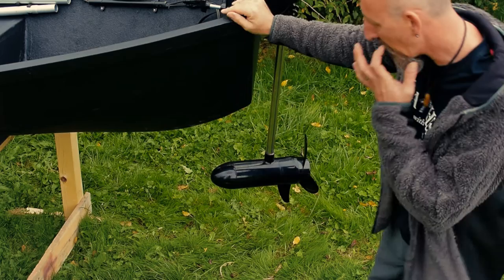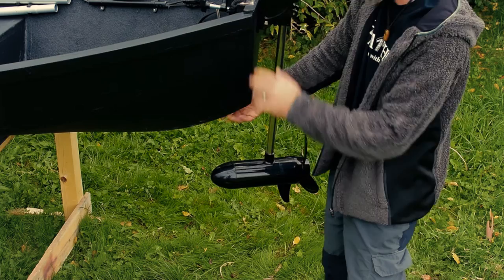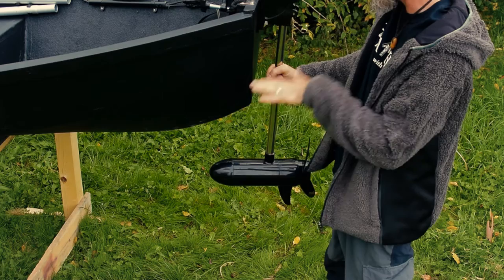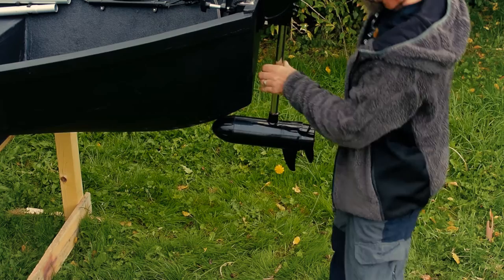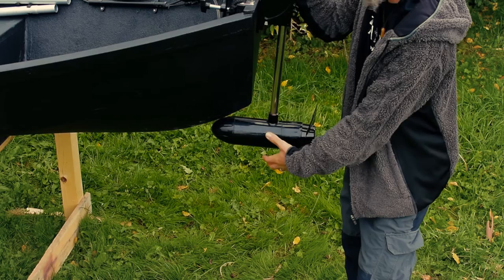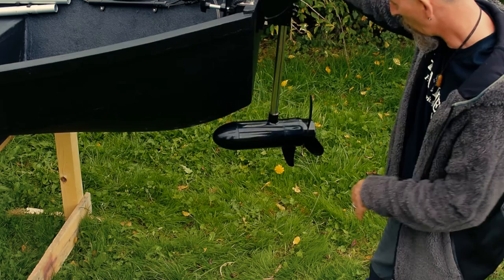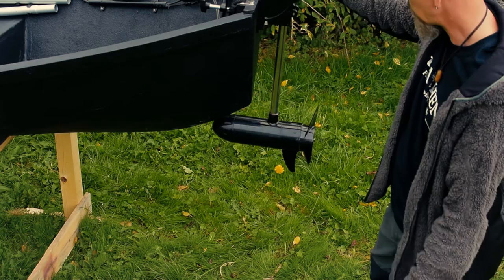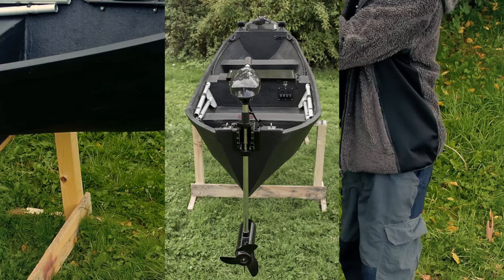The nice thing about how this is set up — it's a flat bottom boat that goes up towards the bow and stern like a traditional open canoe or skiff. In really shallow water, I can just adjust the engine up. I've got clearance for steering, and this sits well above the centre of the hull. So on shallow water, as long as the hull is clear, I can still run in quite shallow water without causing damage to the prop or the skeg. You can really get into some shallow water on rivers where the water level varies quickly.